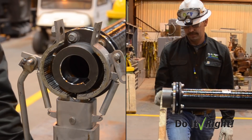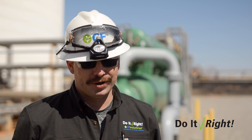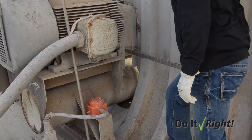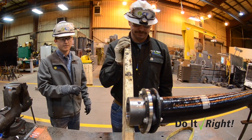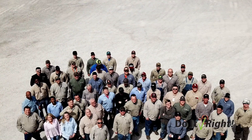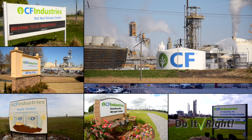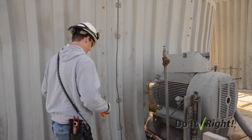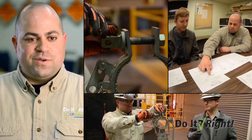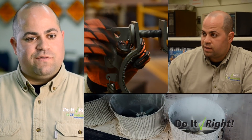It's a much safer way to stop the fan instead of using the board. You use the mechanical advantage on the shaft that's secured instead of having your 2x4. It is a foolproof system as far as securing the fan from rotating. We would hope that it could be a CF-wide thing. Hopefully we prevent an incident in the future at our other sites. CF leads the way — we try to look at a problem and don't try to prevent it by just putting a band-aid on it. When you know that you did something that impacted the whole industry — how to stop a fan — I think it's just awesome.